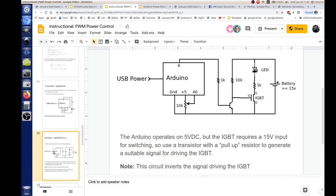Well, what's our formula here? We said it's going to be 3.8 volts and we want 20 milliamps. So we'll take 3.8 divided by 0.020. So that's 20 milliamps, and that would be 190 ohms. That's what we'd have to drive it at, and usually those LEDs, that's their spec. That's what they're rated at for max current.